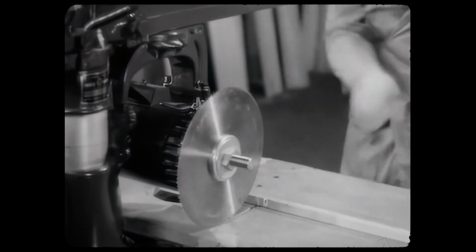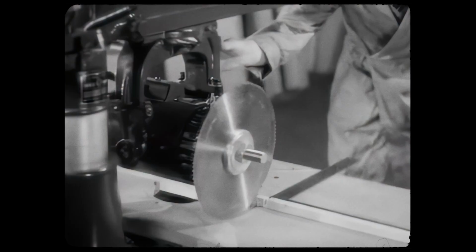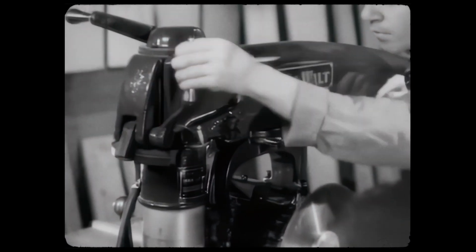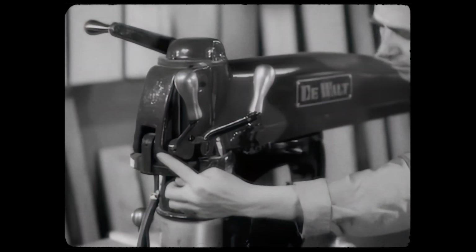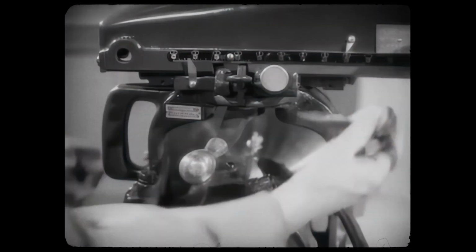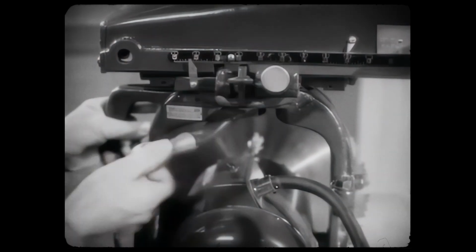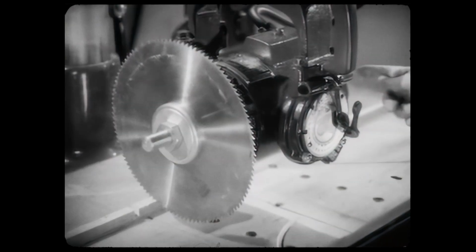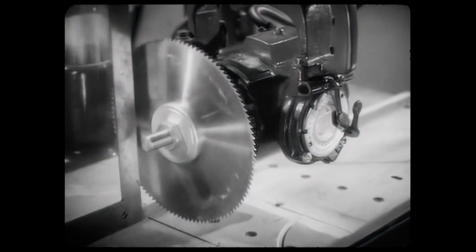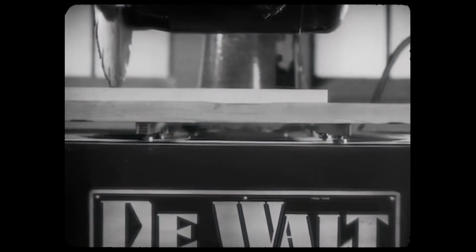Rigid mechanical adjustments are provided to maintain the accuracy of every setting on the DeWalt variety machine. A square is used to check and maintain the accuracy of cross-cutting. Opposing set screws at the rear of the arm are provided to locate the latch so that the cross-cut travel is perfectly square. The blade or dado is maintained parallel to the arm by opposing screw adjustments, or the tool may be given any lead or heel desired. The accurate vertical position of either is maintained by a positive mechanical aligning adjustment and is checked for accuracy by a square. The table can be adjusted so that the tool touches the surface of the work in a perfectly even scratch line at any location on the work table. These adjustments to maintain accuracy are available to the operator during the entire life of the machine. No other machine has these adjustments.